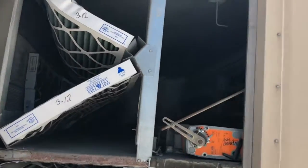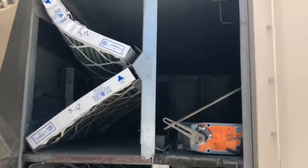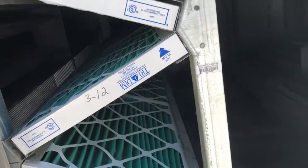I'll show you guys what I see on this unit. If you look at the filters, they're all collapsed and plugged — that's the outdoor air failure. This unit has two distinct air paths. The upper path is outdoor air from an economizer, so it's a 100% makeup air unit. The lower air path has separate compressors.